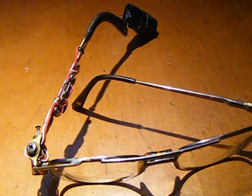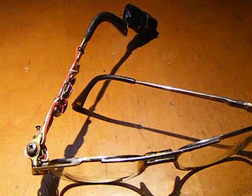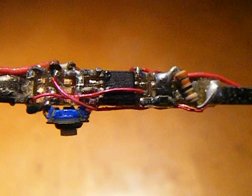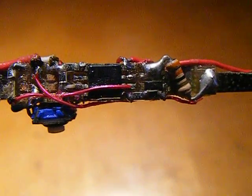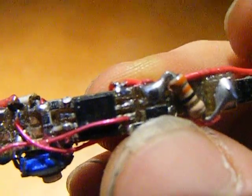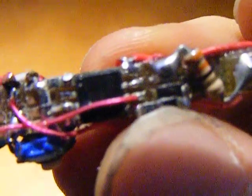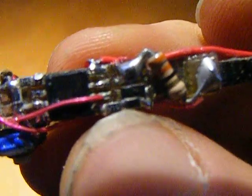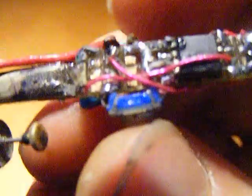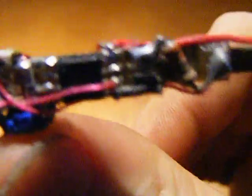That worked nice for a while, then I upgraded it. Now I actually have a little circuit board — a little tiny perf board, basically scratched, it had a grid of squares on it. I've dropped a tiny ATtiny85 on it. Right here you can barely see the 2N7000 transistor that's driving the LED. This is on my ballast. Here's a pull-down and an output protection resistor for the transistor. Over here there's another LED, another resistor, and another resistor, and that's with a button and various things. So I packed that into a pretty small space.